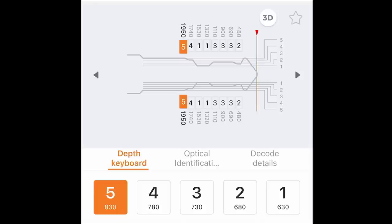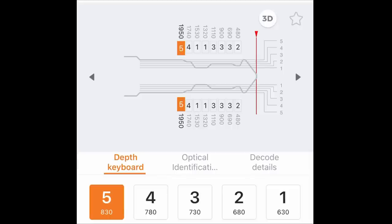When doing wafer swapping, I follow a couple of small rules. First, I like to make sure the wafers I'm swapping are at least one digit apart in size. I'm not going to swap a number two for a number three — those sizes are too close and you may still be able to turn the lock with the original key. If you have a one, swap it for a three or four; if you have a two, swap it for a four or five.